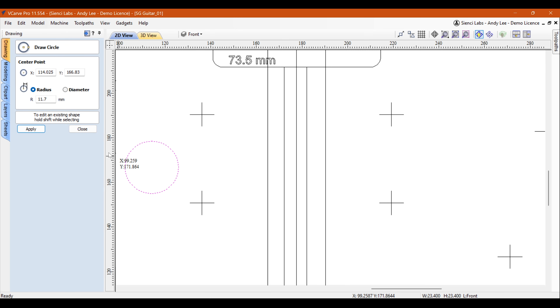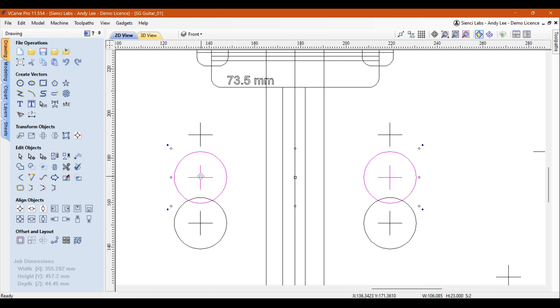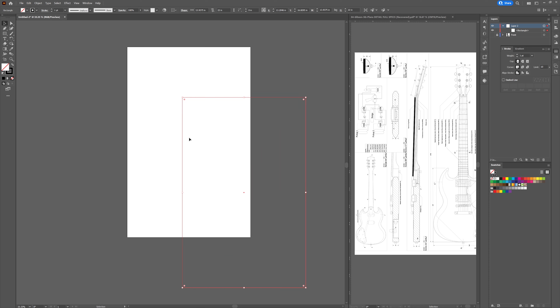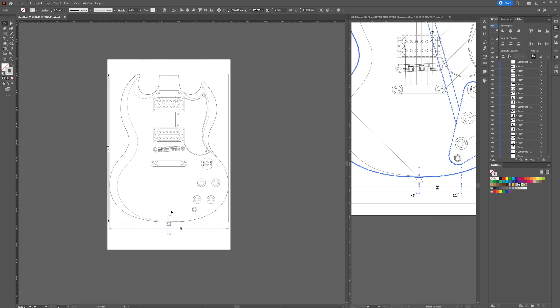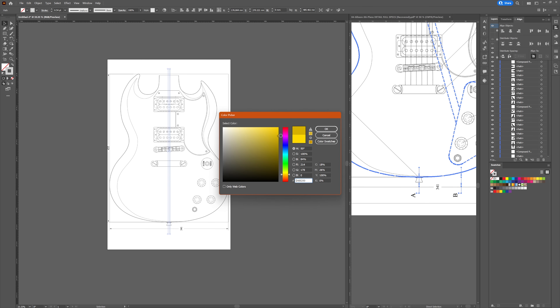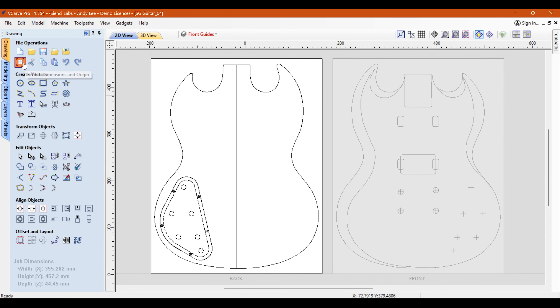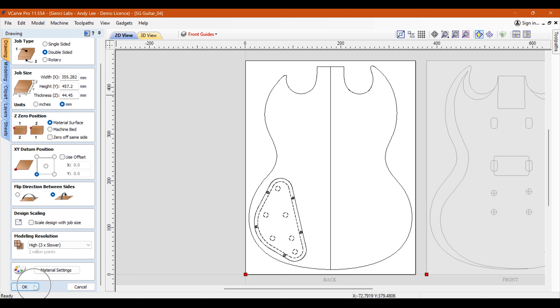If you drew your own vectors, go in and delete any unnecessary info. If you're not familiar with an external vector program you can use V-Carve for this step — I just prefer not to. I use V-Carve to create all the pockets and final measurements because that's where I'm going to be carving from. Using a bounding box to center everything on your document makes life way easier, and having a center line centered on your document is a huge reference point when taking measurements. I'm going to set my document up to be two-sided even though there are no 3D models.